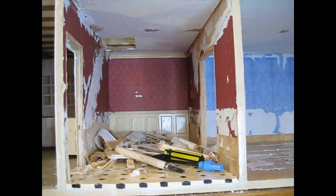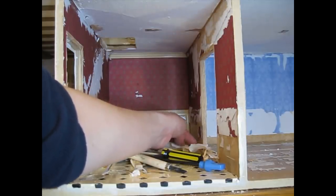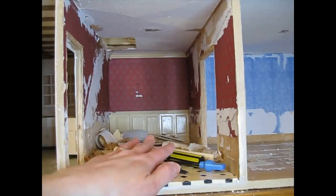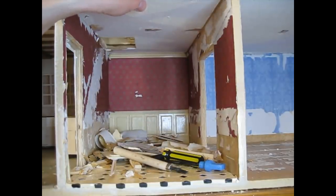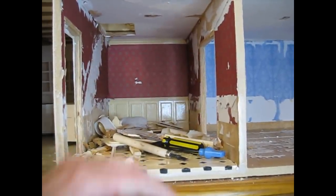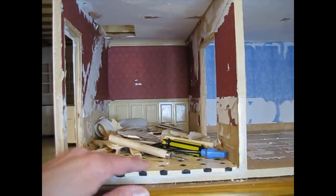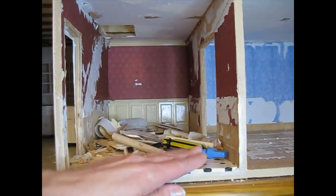Okay, so that's both sides of the entrance hall done, apart from that back bit of skirt in there, which again I think is trapped in by the grout that I used on the tiles. So I'm going to clear this away now, and I'm going to finish here for the day. But when I come back, I'll finish off the back wall of here, then I'll move up to the landing, just because I think these tiles down here are going to take a while to chip out. I might be wrong, they might all come off fairly easily, but I think they're just going to crack rather than peeling off nicely like a piece of wooden flooring, so I'll leave that until last. Okay, see you in a bit.